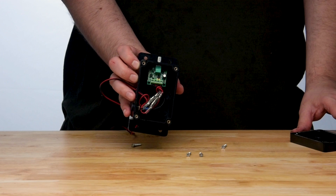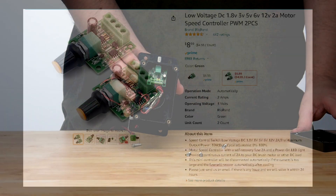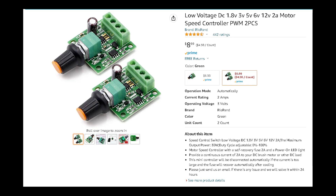What's really cool is that if you inverse the wiring to the motor, the worst thing that'll happen is it'll go backwards — but it's a diaphragm pump, so it'll still go forward. However, don't tempt fate and just wire it in the right direction in the first place. If you do go shopping for your parts yourself, make sure that you get a PWM module, because if you change the voltage, you will destroy the pump. It needs to be 12 volts. Instead of controlling the voltage, what these PWMs — or Pulse Width Modulation devices — will do is turn the pump on and off repeatedly to control the speed.